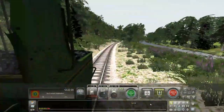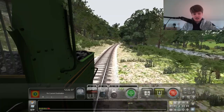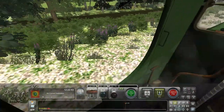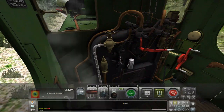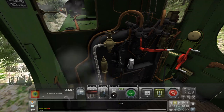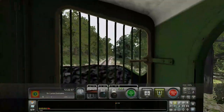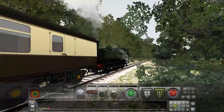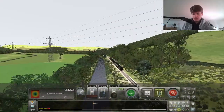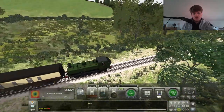Let's blow off - put the water in. Let's speed up a bit and get rid of some steam, we've got too much. Calm the engine down - we've got too much steam. We're up to 57% water. We're down to about 151.4 boiler pressure, which is better.